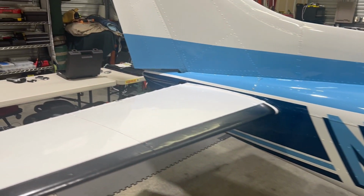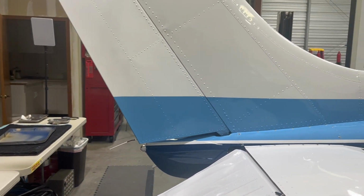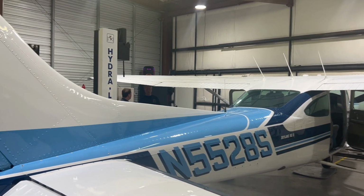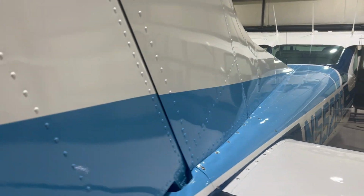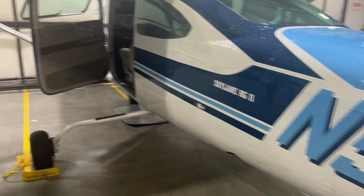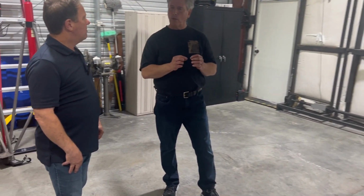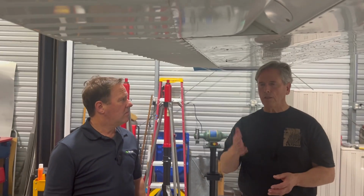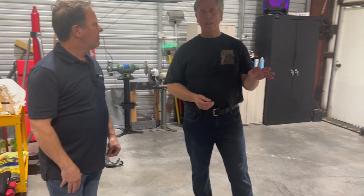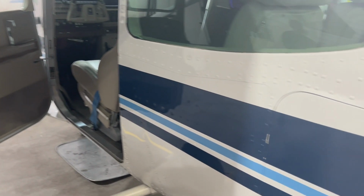I used what's called a hot staple repair process. They also refer to it as plastic welding. You staple it across the cracks with a tool that looks like a heat gun, only it's got probes sticking out of it, and heats up what looks like a wavy wire. You bridge the crack with that. It provides structural reinforcement across the crack, and then you can go ahead and fill that in with vinyl that you heat up, and it's almost like a glue gun kind of a thing, right? It is. That's exactly right. And it's remarkably effective. You can actually make it look like it has the same texture that it had. It's hard to spot unless you point it out. So that's great. Oh, thank you.